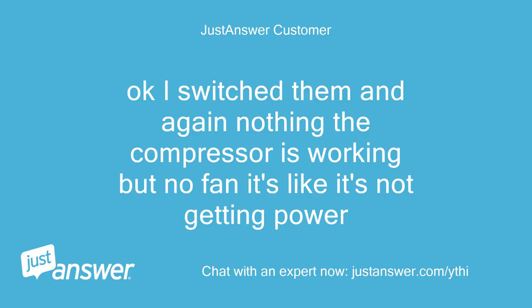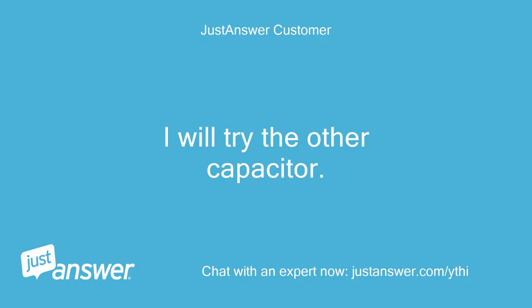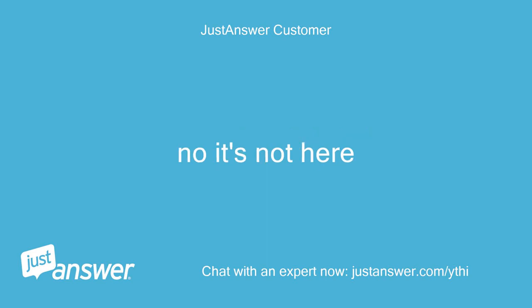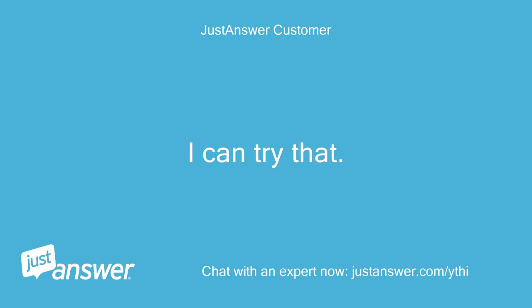Okay, I switched them and again nothing. The compressor is working but no fan. It's like it's not getting power. Do you have a meter to check voltage? I will try the other capacitor. No, it's not here. Or do you want to try wiring it next? I can try that.